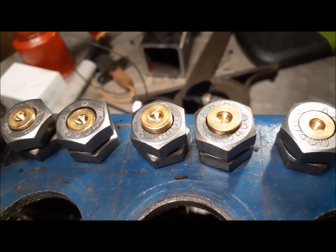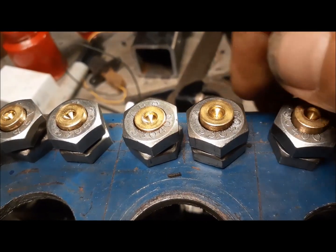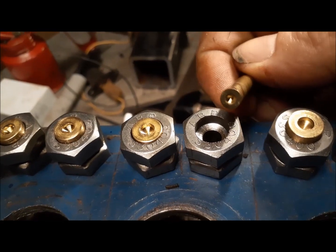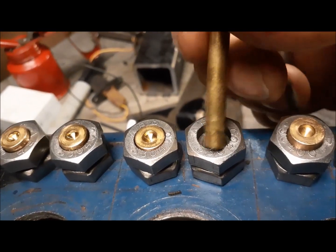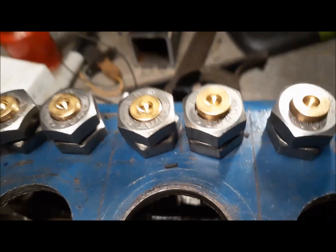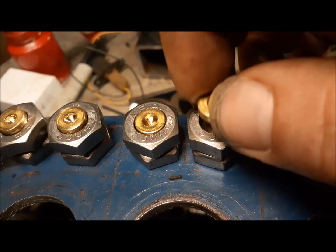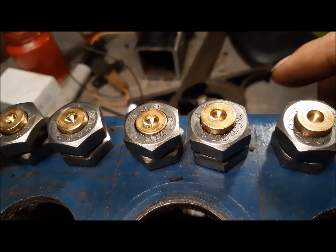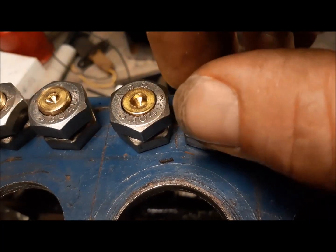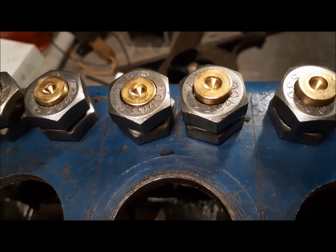And lifters are designed to spin. So the cam lobe actually rides on one side of the base of the lifter. That's why there's a dimple in it, and it makes the lifter spin. The spinning acts like a bearing, like a roller bearing, and it reduces the resistance. I have learned in the past from making other engines, if I make the lifter ride flat on the cam lobe, it actually acts like a brake and adds a lot of resistance in the system. And so by making the lifter roll, it acts like its own roller bearing and greatly reduces the resistance.